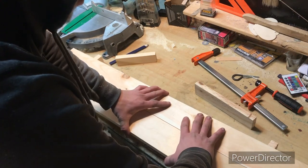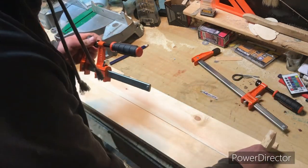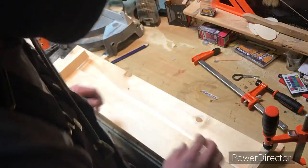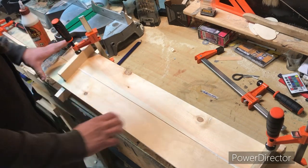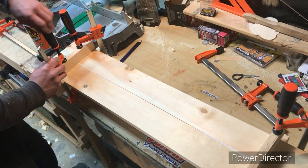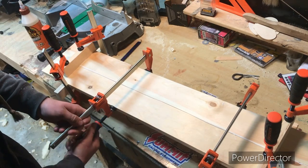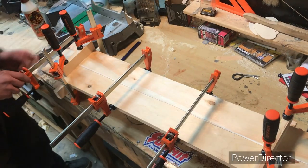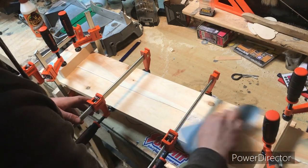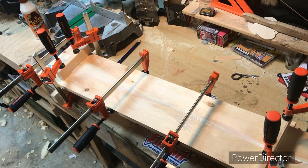Then any glue that comes off we'll wipe up. Next we'll go ahead and attach these six-inch clamps, get this all nice and pressed down. Keep in mind that the only thing holding these boards together right now is a little bit of tension from the glue. You can see because I picked up that side. Also, you don't want to go too tight — go too tight and you're going to defeat the purpose of the clamp. Now I'll wipe off what glue I can and the rest I'll have to sand off once this dries. I wish I had one more set of small clamps.